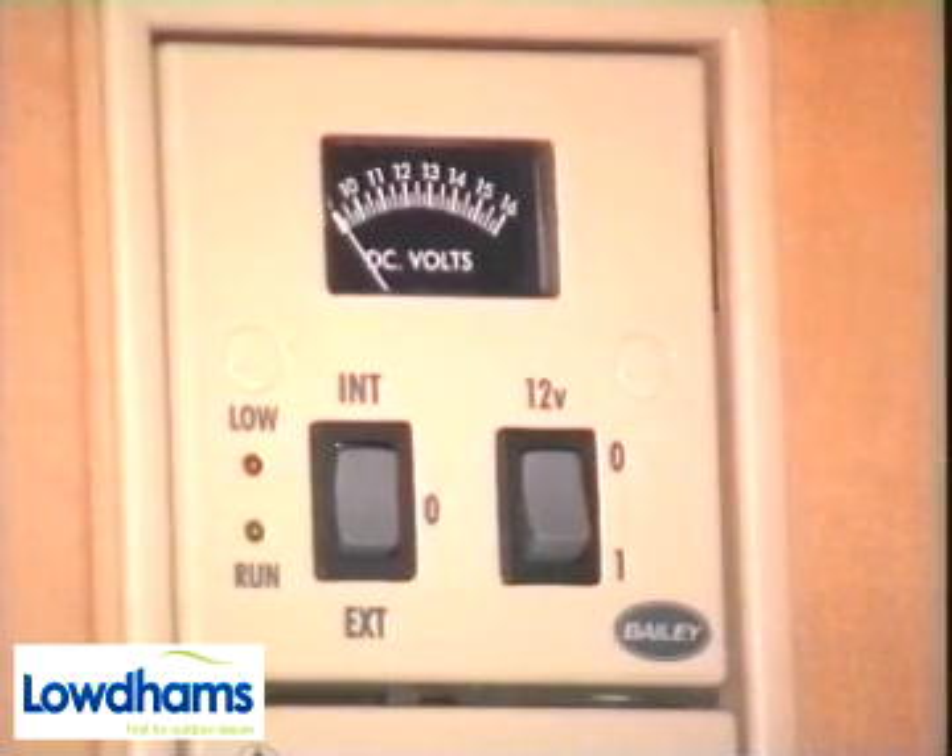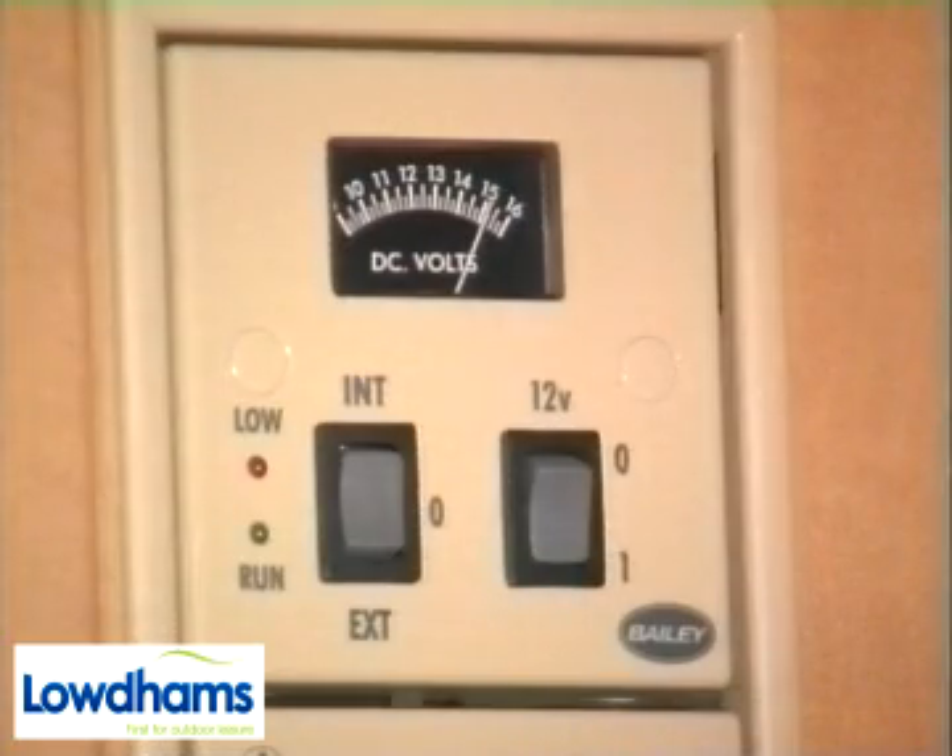Using your battery meter will help determine when a recharge is required. Electrical regulations require fitted battery chargers to have a regulated output. This will not give any problem unless you are trying to charge a totally flat battery. The load imposed on the charger will simply be too great and it will switch off or cycle on and off repeatedly.